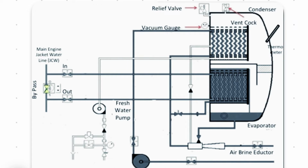So right here, if you can see, we drive the seawater from here through the ejector pump, and there are two tappings. One goes to the condenser here, and the outlet is coming here, and there is a tapping that goes as feed water to the evaporator, and then the remaining water goes through the brine. Brine is basically the salt deposit or sediments. So I'll explain in detail.